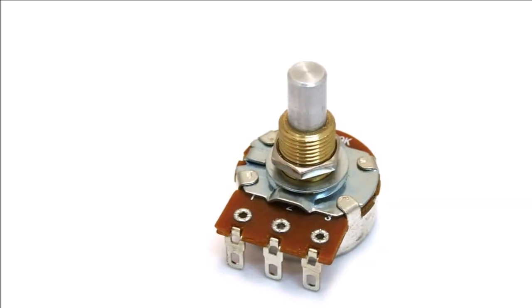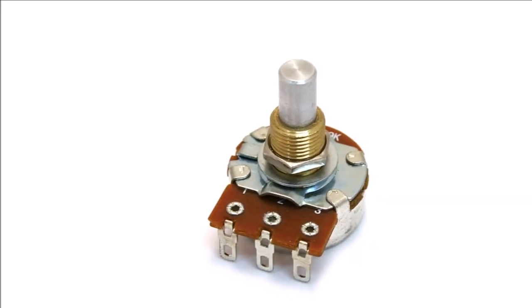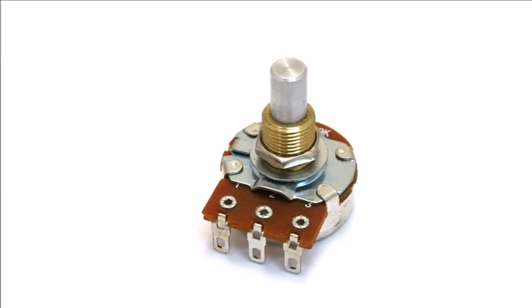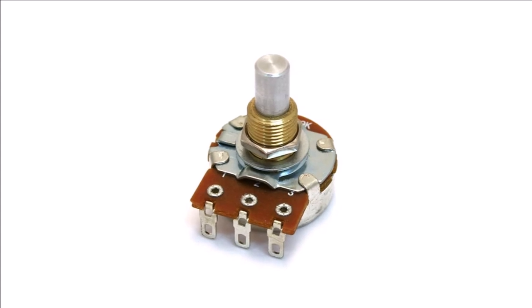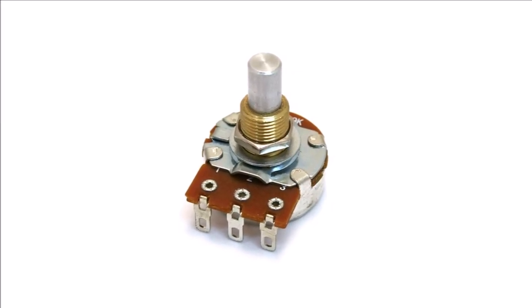But in the real world, let's just stick with turning things down. Now, you might be wondering, why couldn't we just use a potentiometer or a rheostat to do the same thing? You know, you've got a guitar volume knob, that's basically the same thing, you're just bleeding voltage off. First of all, when we're talking about potentiometers in particular, those are only really used in low current, low voltage applications, at least relative to what's happening in this Variac.